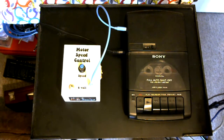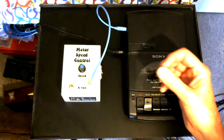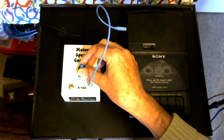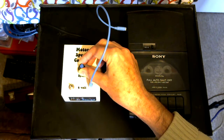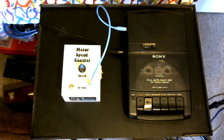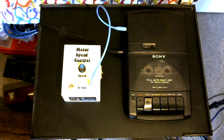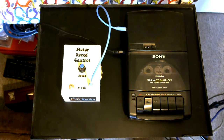By now, if you'd just tried the simple potentiometer trick, the motor would have just stopped dead after that very first turn that I did. You've got a much wider range of control now. Now we're getting into the realms of some real almost tape loop drones, which is one of the ideas I've got using this, when I'm using my tape loops to record a tape loop, and I can slow it down and almost use the tape loop as a drone kind of idea, or to manipulate vocals to give them more impact.